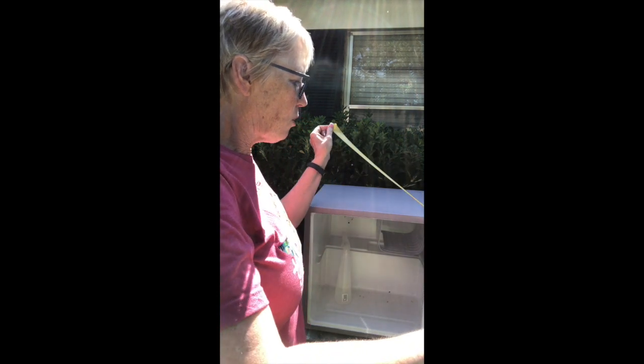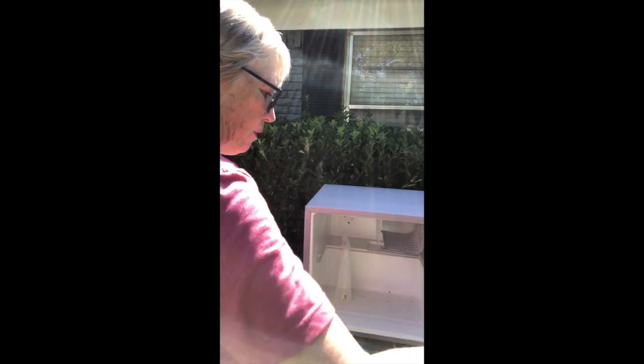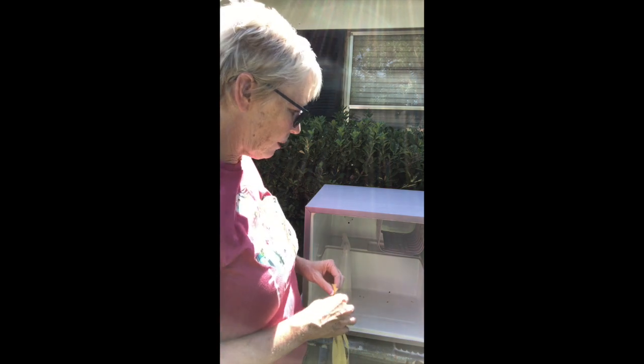And the secret to taping off with painter's tape is that the seal to keep the paint from seeping under is activated by moisture. And so that is why sometimes you can have painter's tape and you still had paint seeping under. So after I get my tape in place, then I go back, I dip my finger in water and I run it along the edge and let the water activate the seal before I paint. And so you can see I've got really pretty lines. So I'm pumped about that.